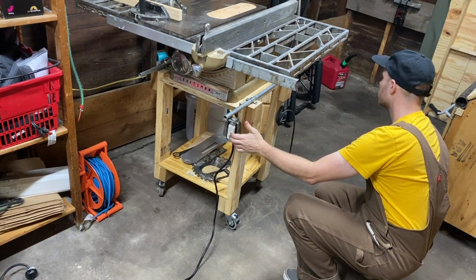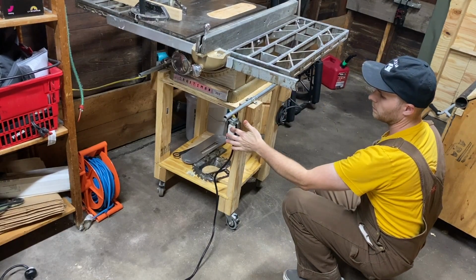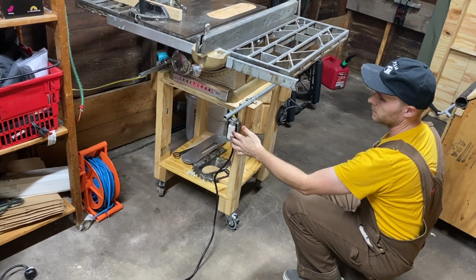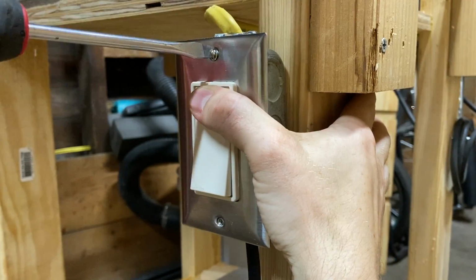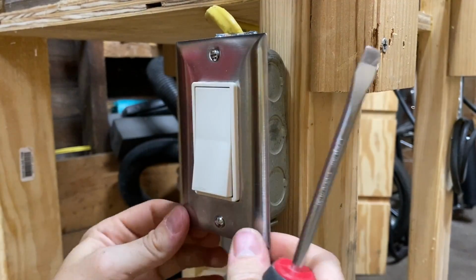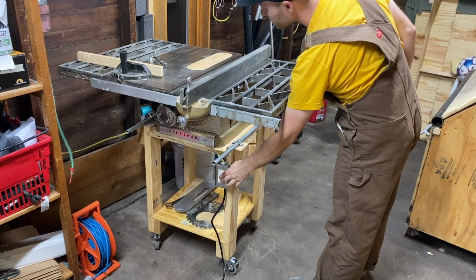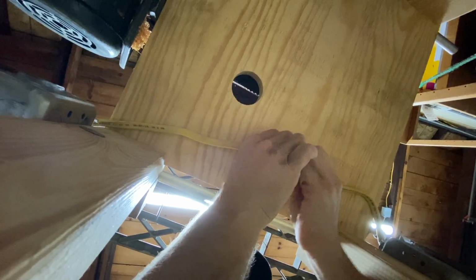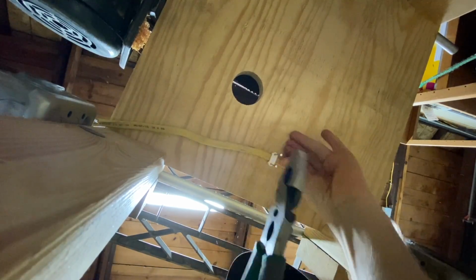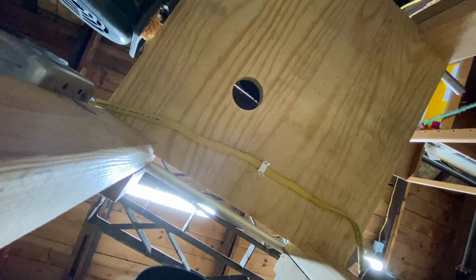Test number 2 had me nervous. Thankfully it was without issue, so I fixed the cover again and for my sanity, tested again. The last thing to do was affix a wire staple to keep the romex from catching on anything. I didn't have as much luck using my pliers as a hammer this time around, so I gave in and chose the right tool for the job.